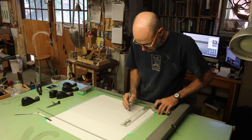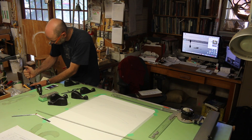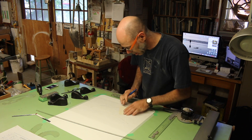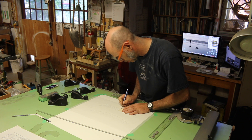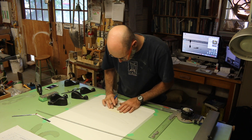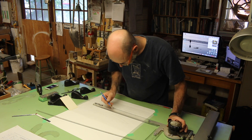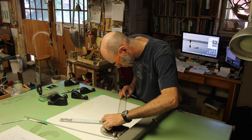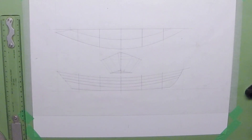Once we've finished our half-breadth view, we can move on to what we call the body plan. This third view is a view of the boat from the front and back end, and everything we create in it is determined by elements already laid down in the other two views. My favorite way to do this is just with a recipe card — I use it to record heights and widths from the other two views and carry them into the body plan. By using this method, all of the dimensions are accurately transcribed. The bulk of this job is really just transferring a few dimensions and then connecting the dots, especially so for a flat-bottomed, flare-sided boat. With our ideation design done, we can move on to making a model and see how this looks in 3D — but we'll save that for the next video.